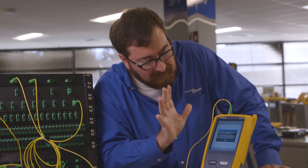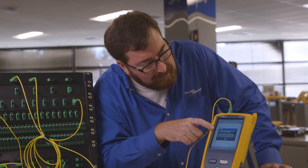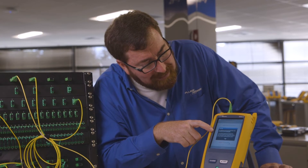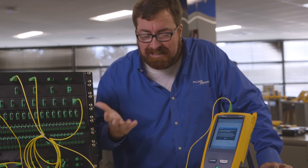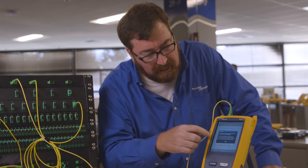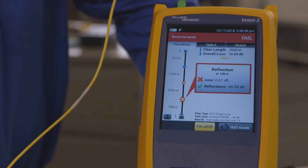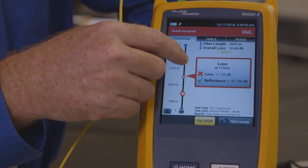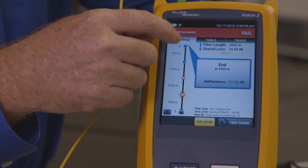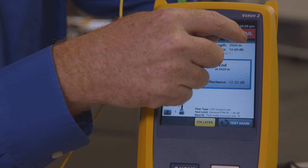Now, it's saying — and this is important — read the error messages, they're there to help. The distance to the end of the fiber is not agreeing at all wavelengths. My fault — I didn't need to shoot this at 1,310. There's the end of our launch fiber, there's a large loss event — my eight-port splitter — then fiber on the other end, and 2,500 meters away is actually my OLT that's doing the transmission.